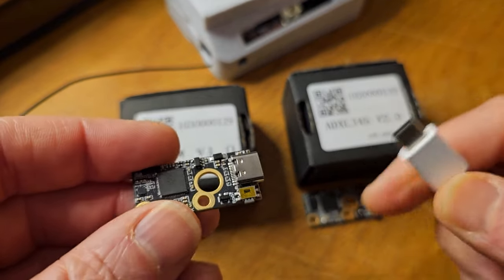When you want to remove the sensor from the machine — especially when you take it off and unplug it — come back to that include line in printer.cfg and put a hashtag in front of it to comment it out. That turns off the sensor so you don't get MCU missing errors or connection errors. That's turning the sensor off and on right there. Hit save and restart, and everything will go back to just the printer alone without the sensor attached. You can then unplug it and remove it from the machine.